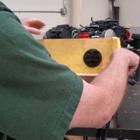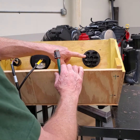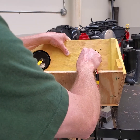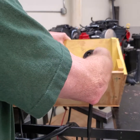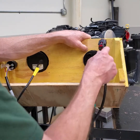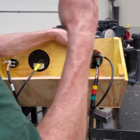When I tilt this up I have my X2 data link. Those connections can't be seen once installed, so an installation poster really comes into play here. You would have your two X2 data links — one for your port side, one for your starboard side. The X2 data link goes on this connection. You have your key switch, which is a Molex connector that also has a lock on it, so you want to lock that. Then you have your multi-link harness plug in the center.